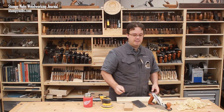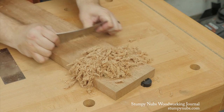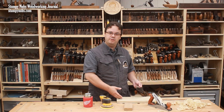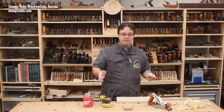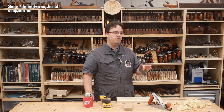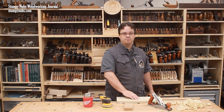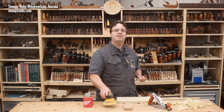What about scraping? Is that as fast as it looks? Like planing, scraping can technically be faster than sanding, because you simply remove a lot more material with each stroke and you only have one grit to work through. But again, depending upon the material, a scraper's edge may need frequent sharpening—far more frequently than a hand plane. Sometimes that's just a matter of reforming the hook along the edge with the burnisher. But anyone who does much scraping knows how often you end up going through the full sharpening process again, especially if you want a smooth surface, because a scraper's edge must be kept free of nicks, or else you'll get ridges in the board's surface. Still, in my opinion, scraping can be slightly faster than sanding.